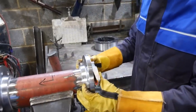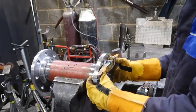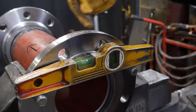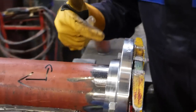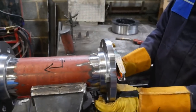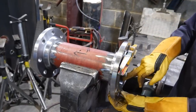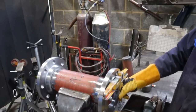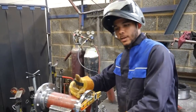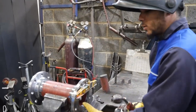I've got my level on it and I'm matching these marks - the bolt holes have to be to the right. See how it's over to the right, and the mark on the back is lined up. What I see a lot of people doing is just sitting the flange on top of the pipe, but that leaves no gap at the top and a huge gap at the bottom. I angle my pipe so I can put the first tack on the back, and that holds a nice gap at the top. When I pull it forward it centers everything.